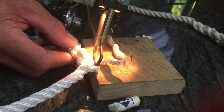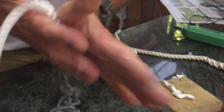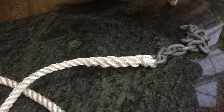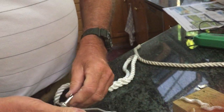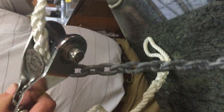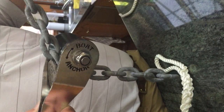You can do this just with a pair of scissors — then, because it's nylon or polyester, it'll melt, so just put a match flame next to it. And there you've got a nice, neat splice onto the rope. Once again, this one will go through the anchor buddy. Feed the rope through there and it'll grip on the rope. As it comes up through there, it'll grip on the splice, and instead of getting caught on a shackle, it's going to go up through there and grip it. If you've got an anchor or a scallop dredge on it, it'll pull that right up to the surface, just underneath there, and the chain will be hanging down underneath.